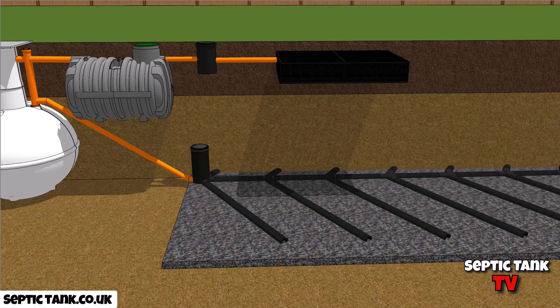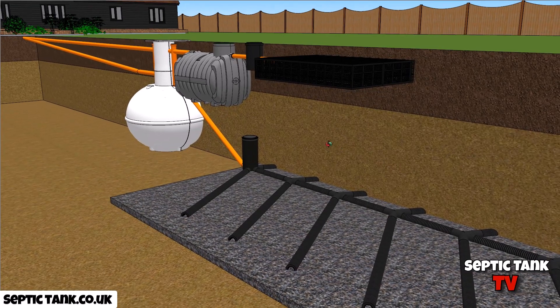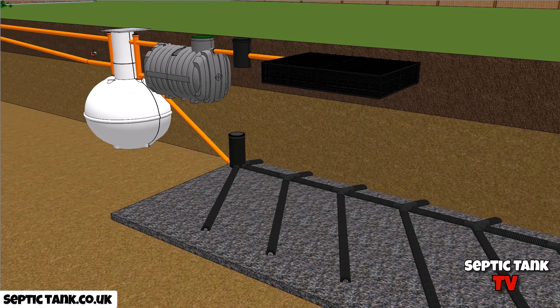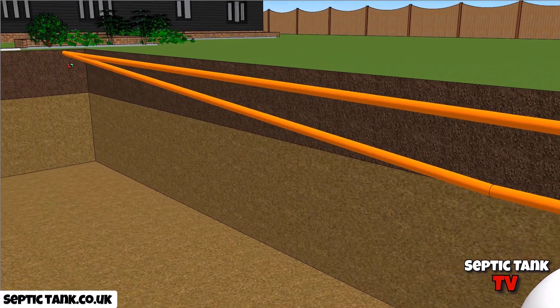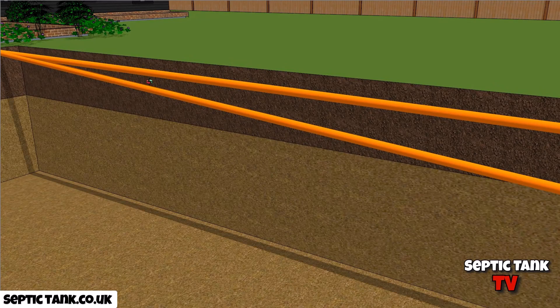For me, this is why I prefer the bullet-shaped septic tanks over the onion-shaped septic tanks any day. Not only are they easier to install, they're cheaper to buy, they're cheaper to install, but you don't get the same problems that you do with the onion tanks and those traditional herringbone soak-aways because the soak-away is in the topsoil. Coming back to the original reason I did this video - the fall of the pipe coming into either tank - for a bullet-shaped system you only need a fall of one in 200.